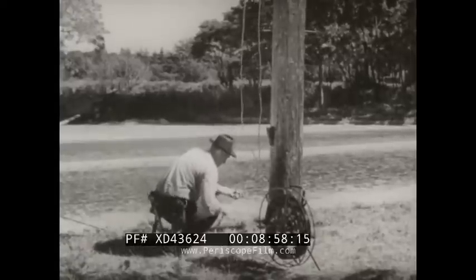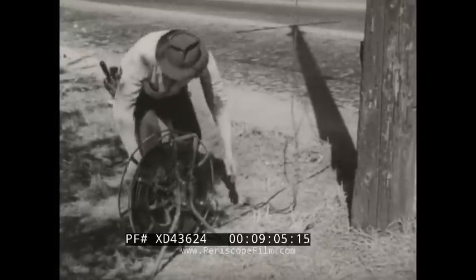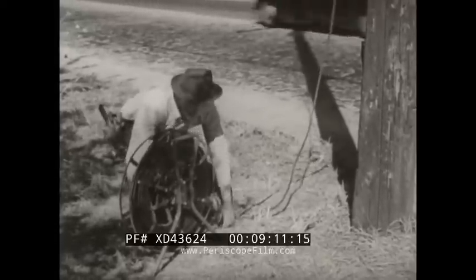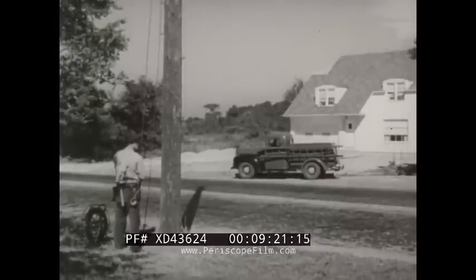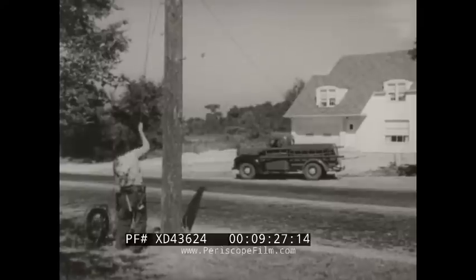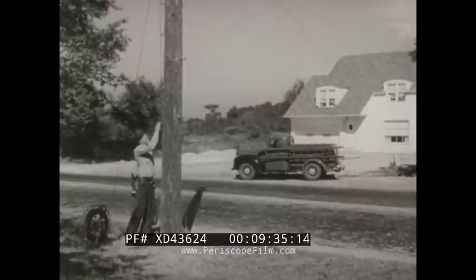The reel is placed away from the street so that the wire will pay off from the bottom. Having tied the hand line around the wire in a loop, Ted rewinds excess slack on the reel carefully without raising the wire off the street, sets the drop wire reel brake, checks again to be sure all traffic is clear, and raises the drop wire. The hand line is made fast near the base of the pole, and the entire raising operation is completed quickly and safely.